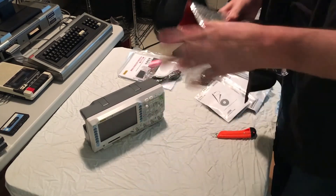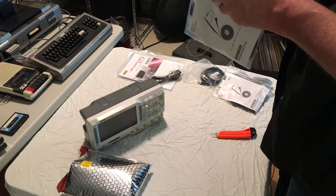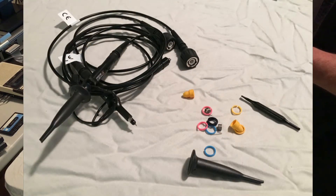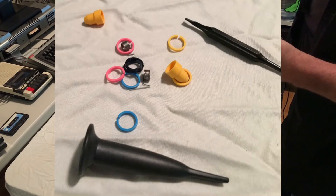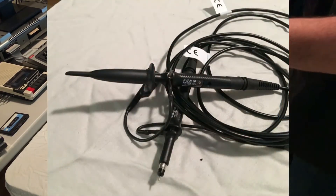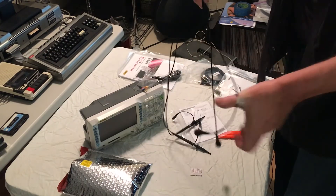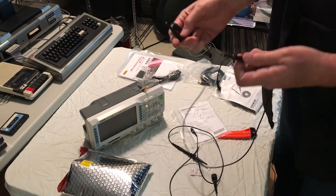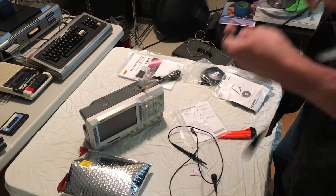I've used several types of logic probes over the years. I have a couple of expensive USB ones here that are okay — I wouldn't call them spectacular, but they've done the job. The standard probe set looks pretty standard: you've got a little adjustment tool for the scope probe, high-frequency springs, and little colored discs to identify each probe. A set of two, nice and wound together. It's a very standard probe, rated for 150 megahertz, which pairs well with this 100 megahertz scope.